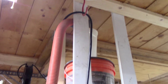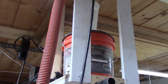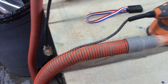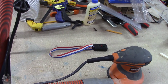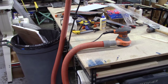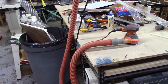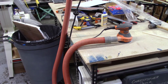The point of the video was that I've got the vacuum cleaner up on the ceiling, which gets it out of the way — I no longer have the vacuum cleaner and the dust separator on a cart that I'm constantly tripping over. The vacuum hose is long enough to reach most areas of the shop, about 15 feet. I've modified the sanders to fit the vacuum cleaner hose, and I've got the remote control to keep control of the vacuum right here. I'm going to try to upload a video every once or twice a week as I put this shop together and keep the videos short.